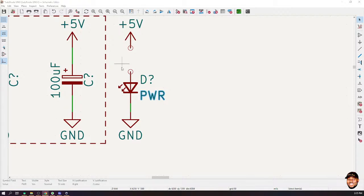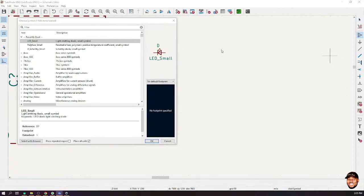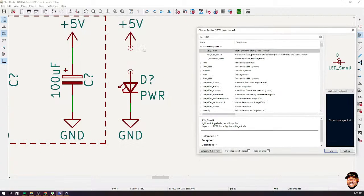This is when another type of component called resistors comes in. Fortunately, the session where I talk in depth about resistors is tomorrow. So I'm still going to use resistors anyway. But then, God willing, tomorrow I'll talk about the very important things that you need to know when selecting resistors. So let's go ahead and bring in a resistor. A resistor, basically in circuits, primarily has the ability to divide voltage. Usually, this is how I like to think about it, instead of thinking about current. A resistor has the ability to divide voltage and even divide current. So if I put some resistor here and choose the right value, then this 5 volts is going to be split between this and that. But right now, I already know how much voltage I need across this red LED. That would be 2 volts.